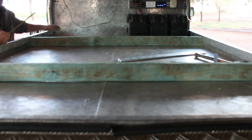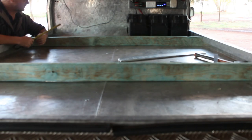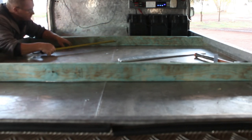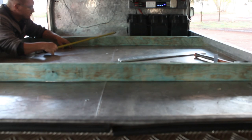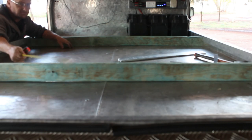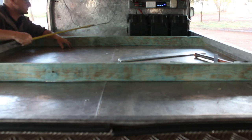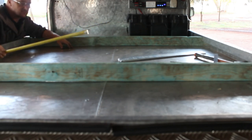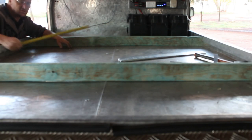And then, after I've done all that, I'm going to put the 12mm marine ply on top of all of this and screw it all down. Once I've cut the 40mm out of there by 35 across, I'm going to be putting a screw directly down the centre on each beam, more for strength, so that way when I go to screw the timber down, it's going to stiffen it up a lot more, in each cavity.